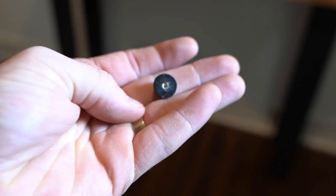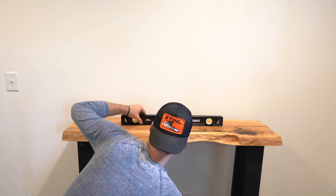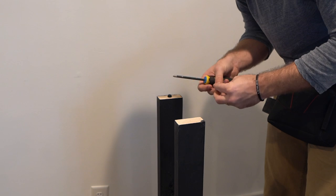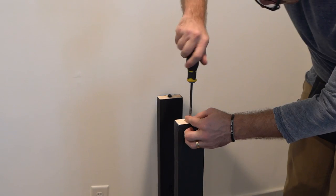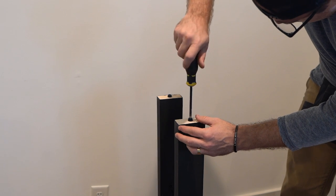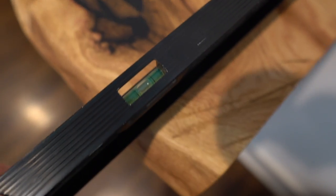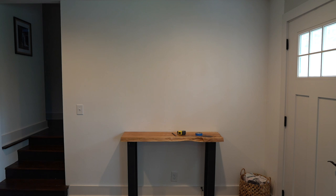I also bought some little footings to help offset the unleveled sections, since I knew the table wasn't completely level and neither is our floor. However, this did not work — if you're going into the end grain of lumber like this, the screws just would not grab no matter how many times I tried on scrap pieces. So I had to nix that altogether. This was also about when we realized the table was just a little too tall, so I trimmed about an inch to an inch and a half off each leg. I tried some felt sticky coaster pads on the bottom of the legs instead, and surprisingly it worked out perfectly — I only put them on three legs, and it leveled the table out almost perfectly. The overall height ended up being 33 inches, with the slab being about an inch and five-eighths thick.